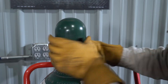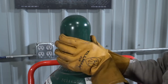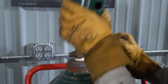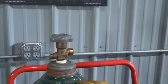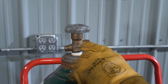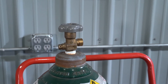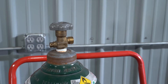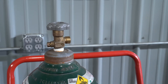Tap on the cap to loosen it, and once you get it loose, release it and it'll unscrew, exposing the valve. Set the cap aside. This is a high-pressure cylinder with a double-seated valve, meaning it should be closed all the way and opened all the way when in use. Wipe out the inside of the seat, clean the threads, then crack it. It's important when cracking this that you get on the other side, always away from where that gas is going to exit the valve.